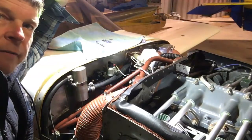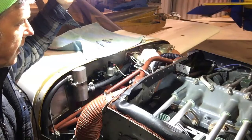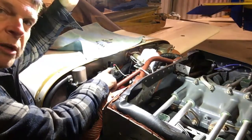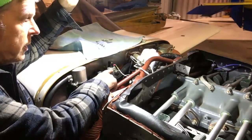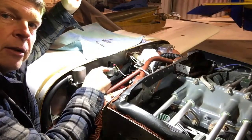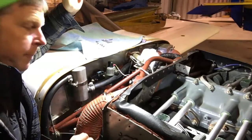What we're going to look at first are the pickups we're using on the system. We have an oil pressure switch here, and this pressure switch will pick up oil pressure. Then down in the magnetos, on the P-lead of the magneto, we have a pickup that can sense the breakers opening and closing, and that's going to count RPM.